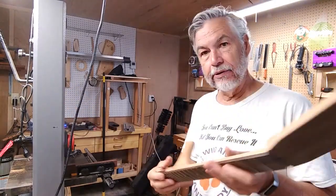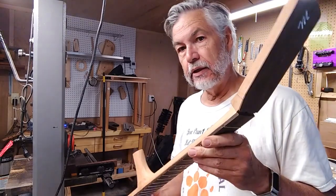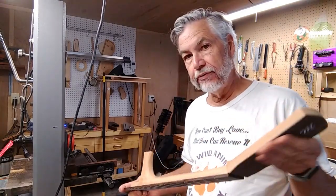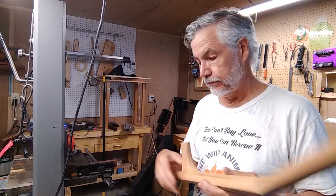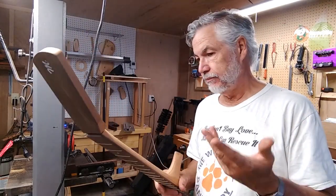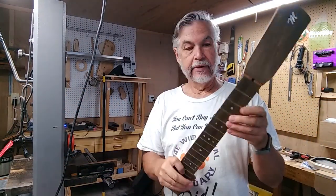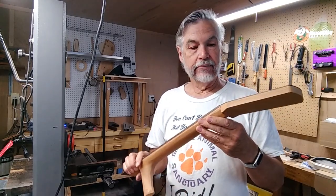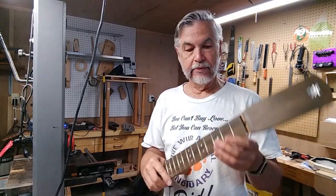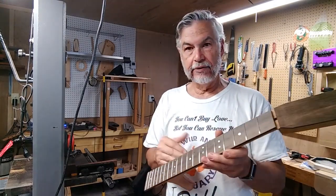This particular wood is Honduran Mahogany. It's getting more and more expensive, but I still use it — I can still get it. I also carve these by hand to certain specifications. You have to be careful that the fretboard isn't too thick, because you need some meat behind these truss rods.